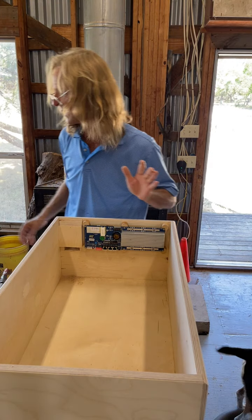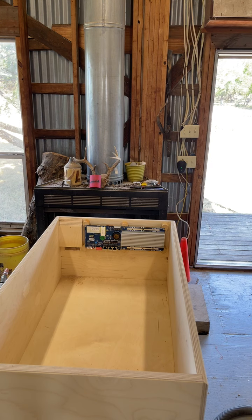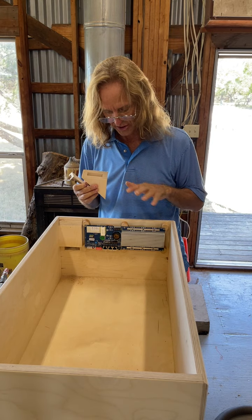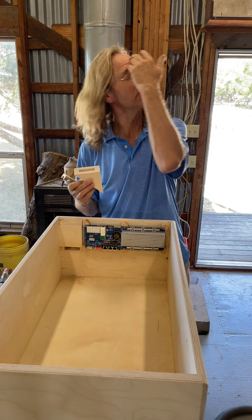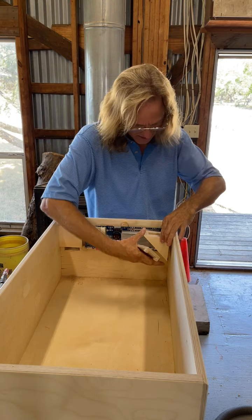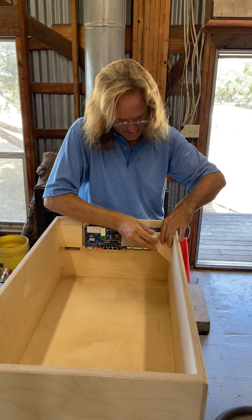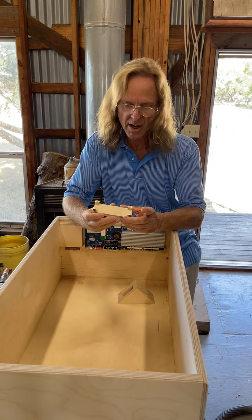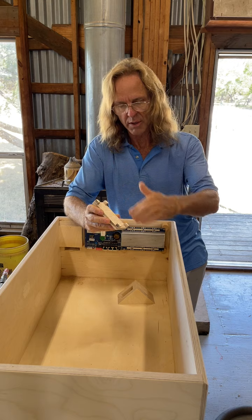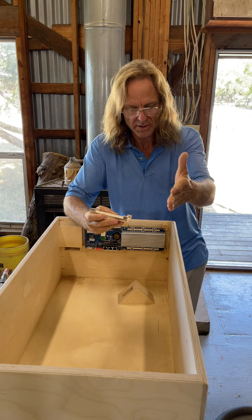All right. Next step. There is a display that goes with this device that shows state of charge and cell voltages and all the rest. It monitors this BMS. And I've decided that I'm going to mount it right here, like this. This part right here I made with a piece of 3/4 plywood and just running the dado blade until I had it ready to just cut parts a piece.